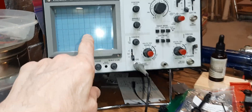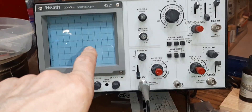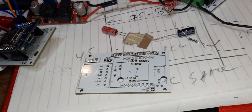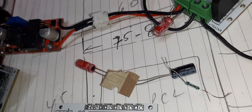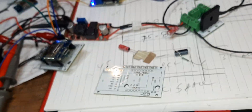I've been studying this all morning and I've got it down to about as good as I can by splitting these two rectifiers and adding a capacitor right there — not a big one, I think it's about a 4.7 microfarad but it's also 25-volt capacity. I put a 10-volt in there and it got a little warm on me, and that's when I realized I was up to 15 volts, so I'll take care of that.